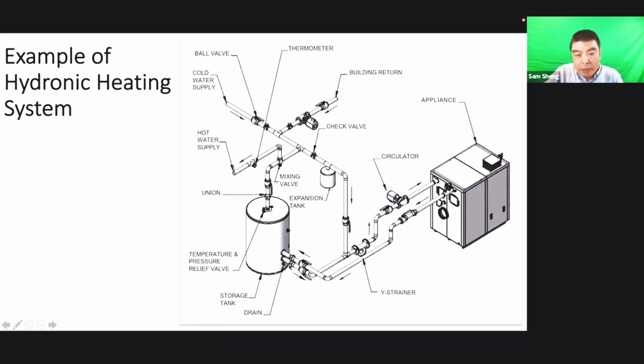To the bottom here. After that, the hot water will go back to the boiler. This is like a small loop here, just to keep the water hot enough for the system. We have a circulator pump here, and a strainer here. The strainer just needs cleaning maybe every half year or one year. If you do the water treatment, it's good, so maybe you don't need to check more often, but if you never treat the water, you need to clean it.